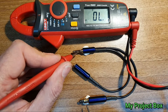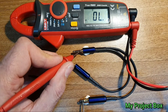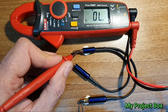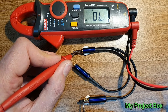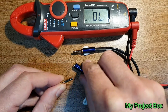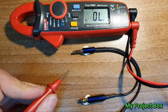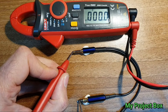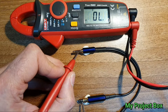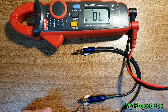This is the microphone socket — so that's the mic signal confirmed. The rest should not be connected. This is the ground — ground to ground. Now let's swap over to the headphone socket. We should have the tip — that's one channel — and the second channel, and the ground. These other pins shouldn't be connected. And here I've connected these two grounds together.